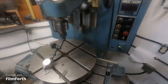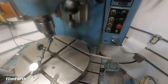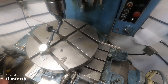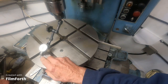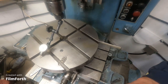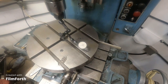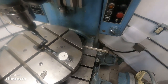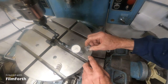I moved this jig bore around and got it over here in the corner. I've only got it leveled with the Starrett number 98 level — I have not put the master precision level on it. So I'm going to bring this over. I don't know if you can read it, I sure hope you can. We were four ten-thousandths before zero on this indicator. It's really tough to tell; if you can't see it, you're going to have to believe me.